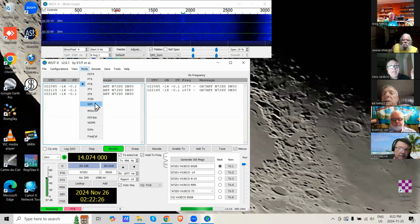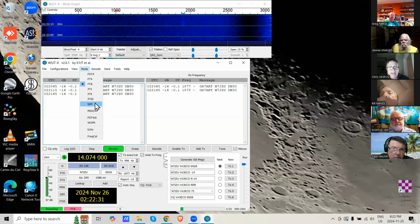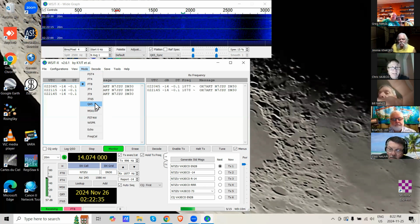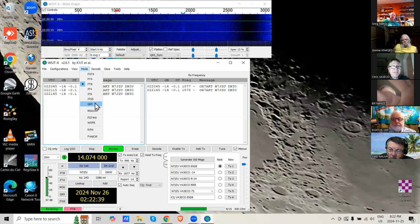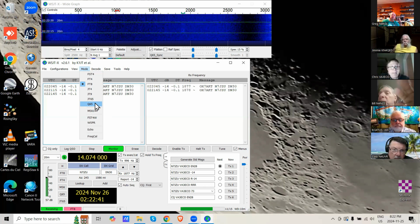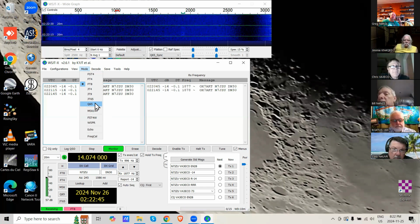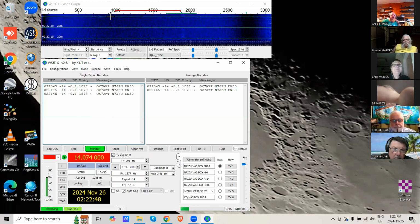And even today, if you have people doing FT8 and someone wants that grid real bad and they're talking by email or on a chat page and it's just not quite working out, they'll say, can you go Q65? They'll say yes. And this will give them another maybe 5-10 dB over FT8 and they'll get the QSO done. So let's look at Q65. That's really what we're here for.